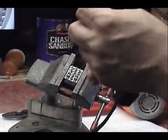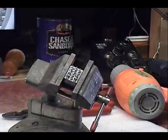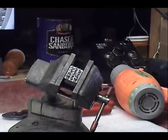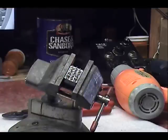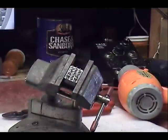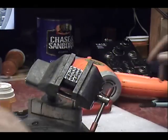Put it over your wire right away because you're going to be mad if you're done soldering and you forgot to put that on. Okay, there's a little bit of complicated jumpers that are inside the DC power cord, and remember everybody that the DC power cord does not go on an FT-101 unless the FT-101 has a DC-to-DC converter. If you don't have that converter on the back of your 101 and you plug this cord in, you'll damage the radio. Make sure you have that first.